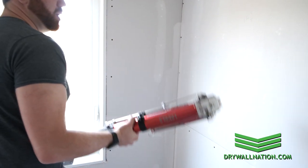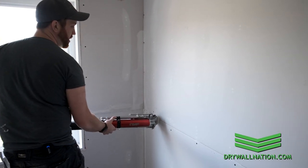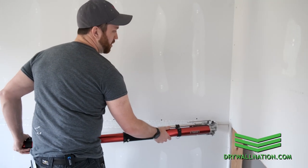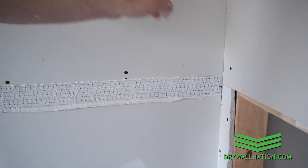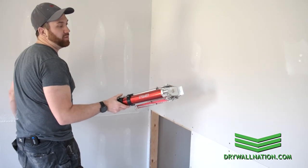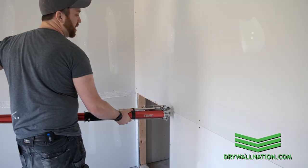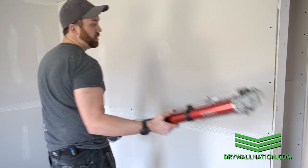We just finished our cut in a corner, so now I'm going to advance my drive mechanism on the wall, advance my tape, and start rolling. Again, you want to get the taper head out in front of your body, have your taper on an angle so you can lead comfortably with the head. As we get about two and a half to three inches from the wall we pull down, cutting that tape — and you can see how close we got to the corner. Our corner tape is going to cover that. Same thing: we just finished cutting, roll the drive wheel on the wall, advance the tape so there's mud on it — that's again called charging or loading your head. Now we're going to pinch our tape to the wall with our drive wheels, lead with the head of the taper, and cut about two and a half to three inches back.